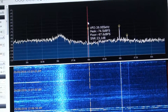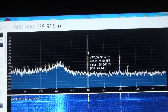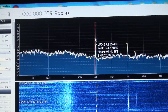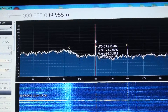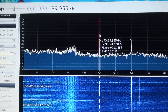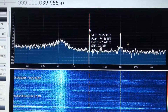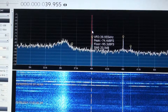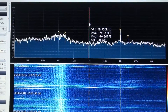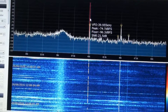So there you have it — audio sound card versus SDR radio. Keep in mind the SDR play was really not designed to work down this low; it only claims to work from 100 kilohertz to 2 gigahertz. For the money it's an excellent receiver with nice frequency coverage, fairly easy to set up, and very sensitive — without doubt the most sensitive SDR I've had in terms of raw sensitivity. It's a very nice software defined receiver for the price, as obviously there are better SDRs that cost three to four times more.